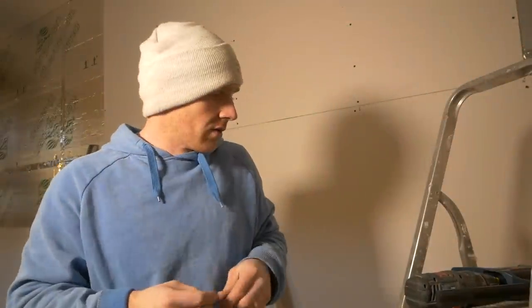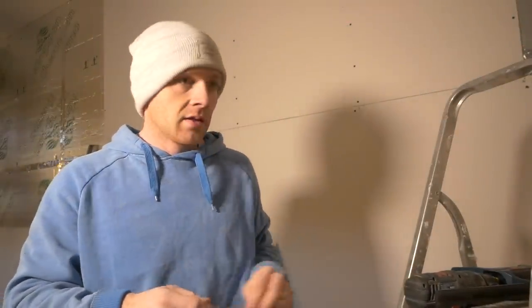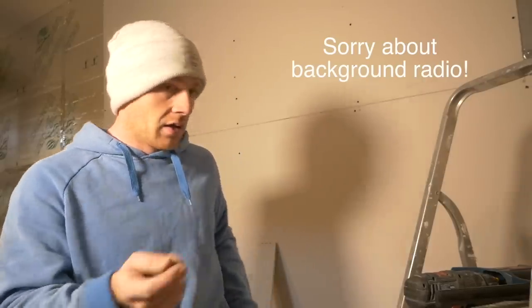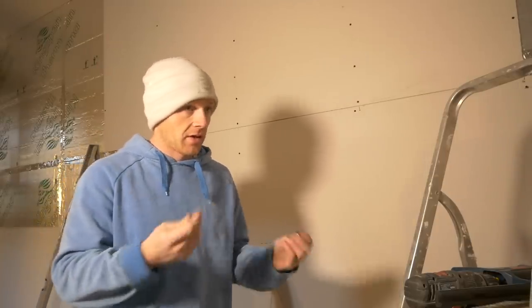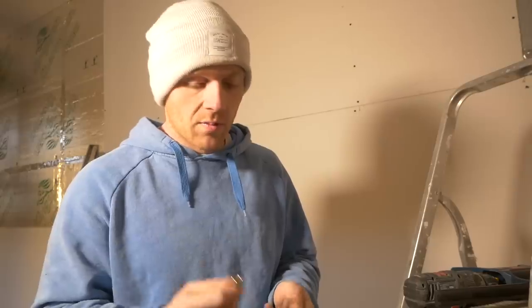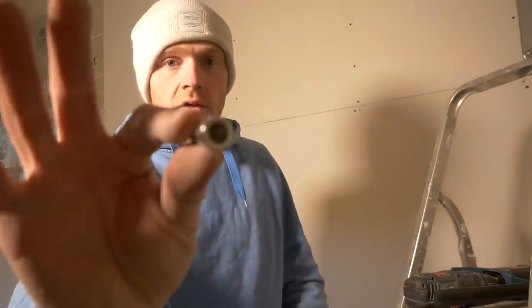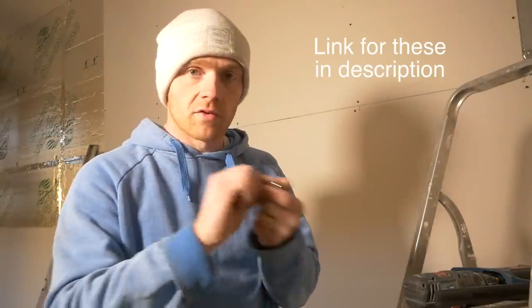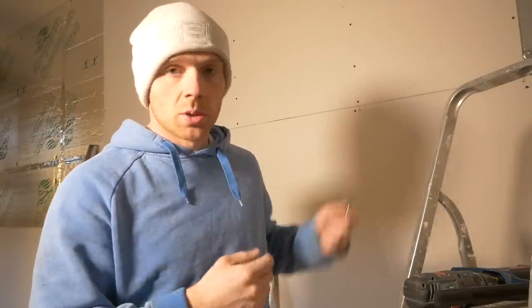Right, quick little video on a bit of an update, a tool update, I guess. So far on the plasterboard, I've just been using a standard drill and putting the screws in manually, which is fine. I've done the whole house that way. When I do that, I use one of these screw bits, which has a little collar that stops the screw going in too far and puncturing the paper.